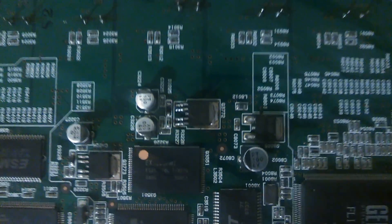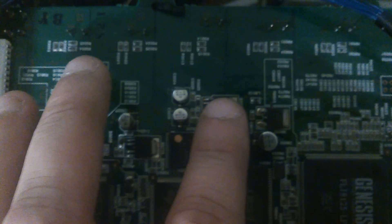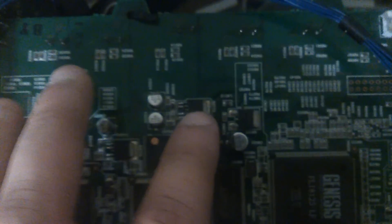There's another one we looked at on the schematic that's powering this DSP chip — I'm assuming it's attached to this one. I unsoldered this and reflowed it just to see what would happen, and when I powered it on I didn't get any display or anything. It did still do the click-click relay things. Before I made this video, I noticed there's another little component — Q1912 in the schematic — that's a transistor and it gets hot as fire too.